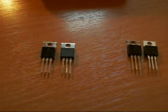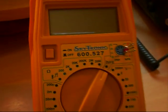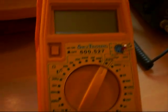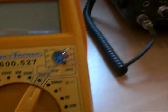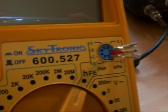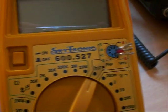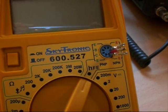We're going to be testing two sets of transistors here, two pairs. First thing we're going to do is show you the HFE readings from these transistors on this basic electronic test multi-tester — a typical example of many that people own. It tests currents, voltages, resistance, diode checks, and various other things, and of course it has a socket for testing HFE on transistors. This one I've adapted slightly with some little pins on the socket, because the actual socket isn't really suitable for TO220 style transistors, so I've adapted it to make it much easier to plug them in and out.